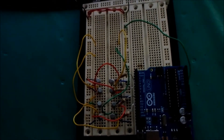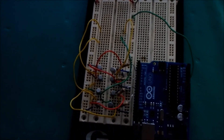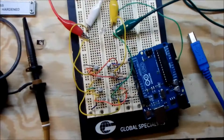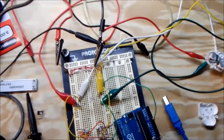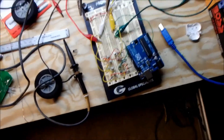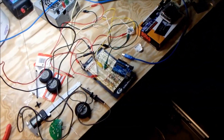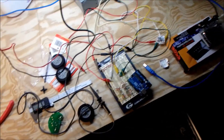I'm going to put this back together and hook it up to a stepper driver to see how it works - if I can even make a stepper driver. I have to make a stepper driver out of transistors and an Arduino just to test this, though I'll use an actual driver chip for the final version. Unfortunately my little dual H-bridge stepper driver isn't going to work because I don't have enough components here - this little thing is very picky about power. So I'm going to work on the lights and getting more pinouts until stepper drivers arrive, courtesy of Zios.